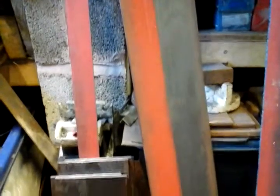Now I'm going to machine these edges up square, and then I've got to saw this one the same. So basically, I've got this steel for my frame for half the price of buying ready-cut steel frames, if you like. So straight away I've saved 50% on my frames, and that's how I'm going to be doing the rest of the loco. I'm not going to use castings where I can manage to manufacture them and fabricate them and machine them up on my machines, on my lathe and my milling machine.